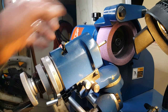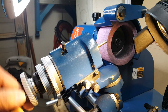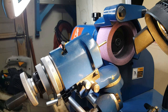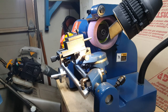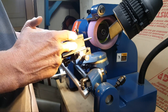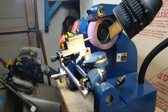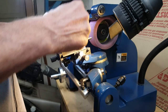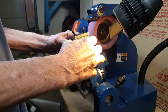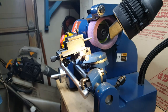It's got a pretty good flat on it. I wish this angle wasn't in there but I'm not sure how to take care of that. It did start getting a little bit hot but oh well. Now I'll set up for doing the d-bit part. The gibs were way too tight — couldn't get it in there. The dovetail on this is wider than what was on here for the collets. It's oiled like crazy but it just jams right there — easy to move here but sloppy up here. I've got to do some work on this.